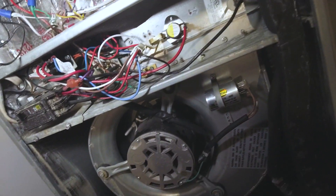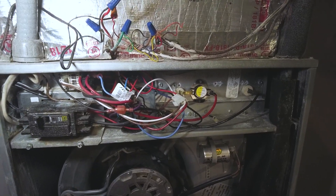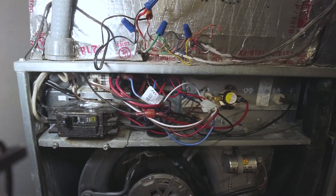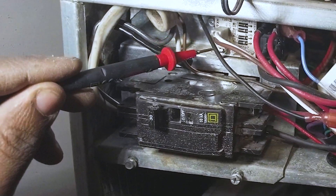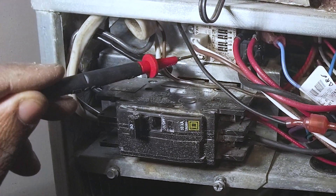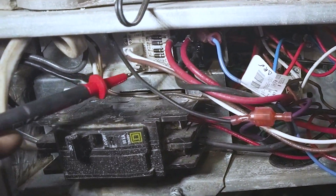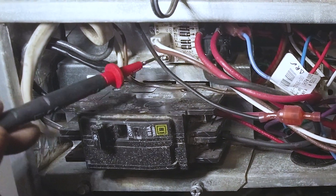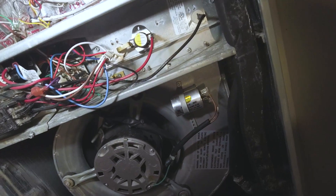So yeah, it was nothing more than the relay itself — the rectifier was still good. Please leave a comment if you know what that rectifier is for and why you can't just use straight 24 volts AC to energize that contactor. Looking at the back, the contacts aren't on a direct 24V circuit — the signal actually goes through the rectifier before reaching the terminals. I'm not sure why that contactor needs DC voltage.